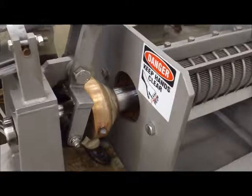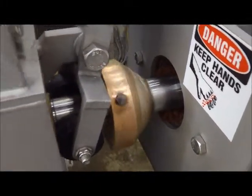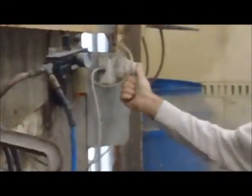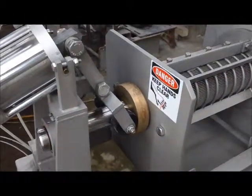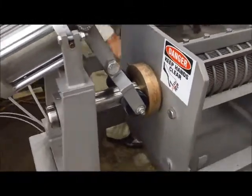Usually we'll start with the cone open until you see some material falling out of the end, and then, utilizing the four-way valve, close the cone. The press comes with a filter regulator lubricator and that cone reversing valve.